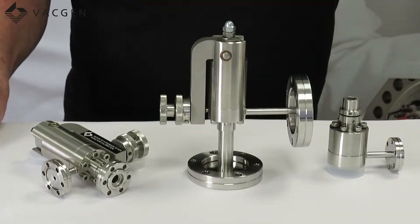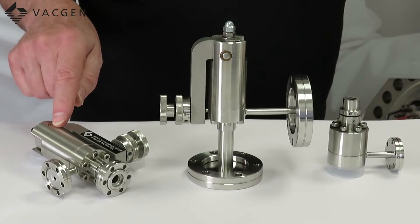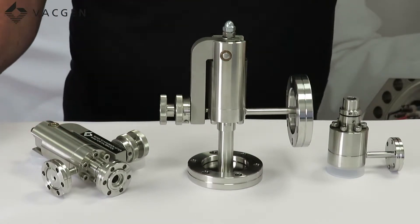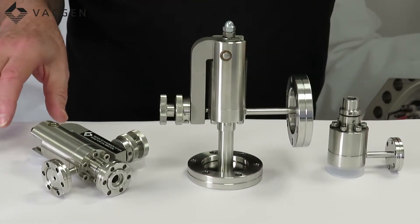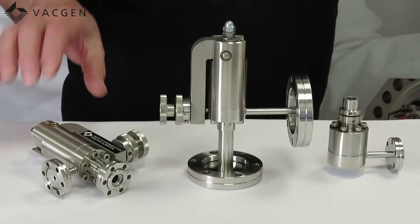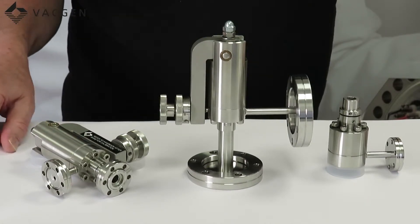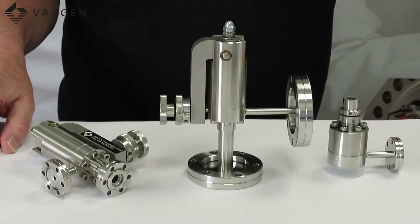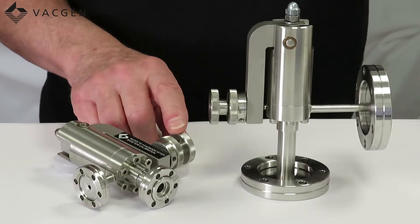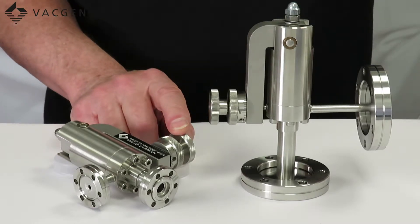We have on the table the two types of valve that we sell — the LVM version and the MD version. The LVM version is sealed with a Mallory powder, which is superior over the ones that seal with sapphire because you cannot have a catastrophic failure with these. With the sapphire, if it splits then you've got a seal that you cannot physically seal. The LVM valve has a linear style control knob which gives you the same control as the sapphire seat valve does but without the problems of the sapphire seat.